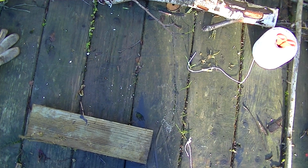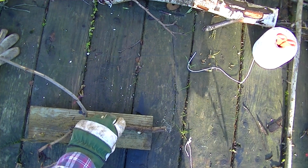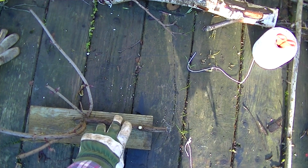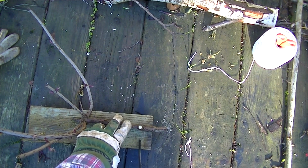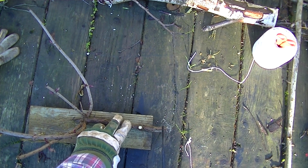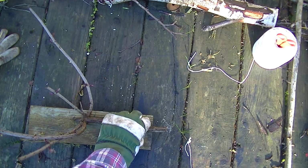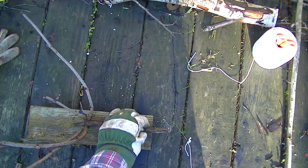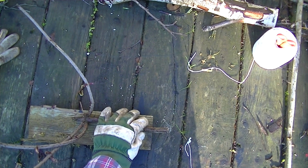We're usually going to cut over the edge of a table. Apologies for all this noise, but the building site's very busy this morning, if you can hear all that. We're going to put the elder over the edge of the table. As I'm working on a table, I've just put this block of wood here to raise it up, just to show you. You're going to use your holding hand and lock it really tight, because if this moves, it's going to be very hard to saw. These are the principles for all sawing wood, so it's really good to learn them now.